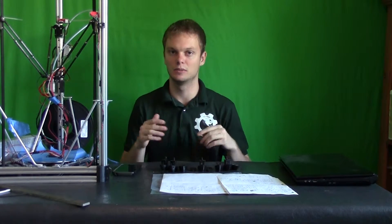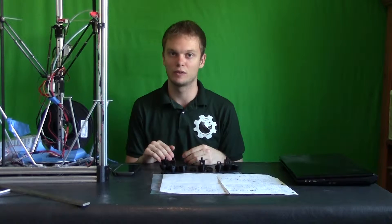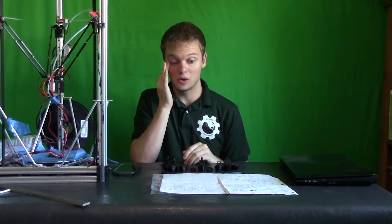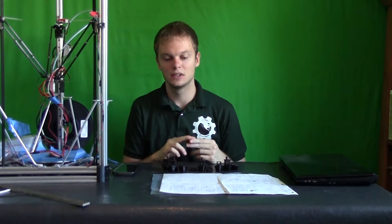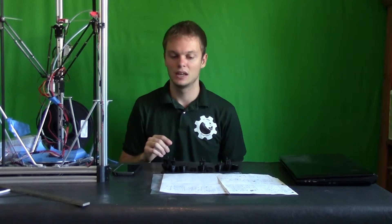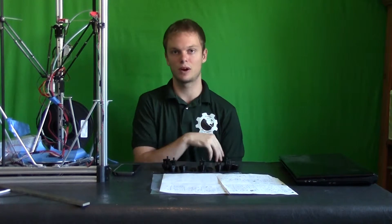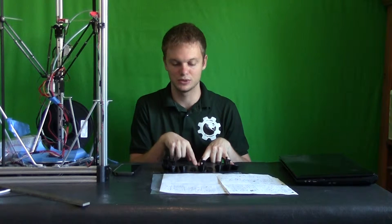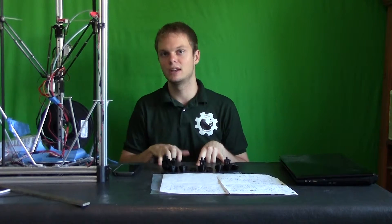Number two: do you have to worry about moisture content of filament sitting in a room environment impacting your prints? The answer is not really. We've had filament with twice the moisture content and filament with zero moisture content, and the varying difference in surface quality between them is very little. We've covered baked, room environment, and samples at 0%, 0.3%, and 0.6% — and the difference between the three is very little.